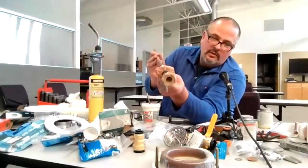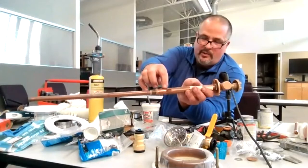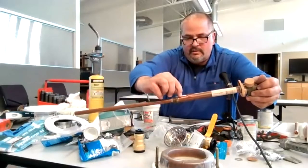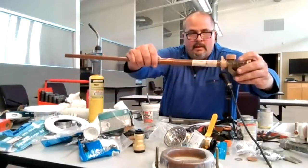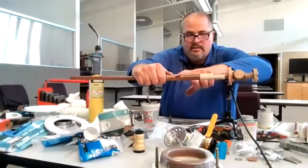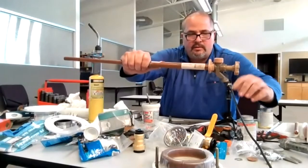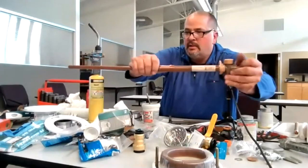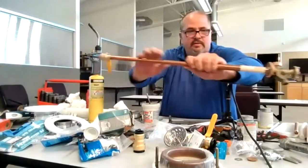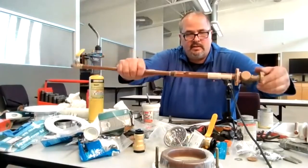I also brought a spigot tonight — there's a hole right here in it. This spigot goes on the house, and it was in a brick house and it froze. This is what happens when it freezes. When I turn this off it shuts off right about here, but what happened is the water wasn't completely out, they had it shut, and it built up pressure from the cold air and it bursts. Make sure when wintertime comes, before fall ends, open all this up and let the water drain out. When it's done dripping, then you can close it — but make sure the valve is off. Open this up, drain the water, make sure it's done dripping, then you can shut it. This prevents it from happening.